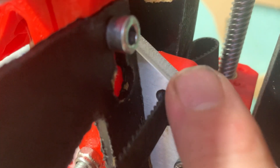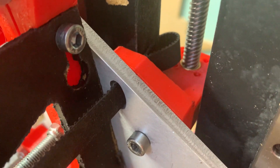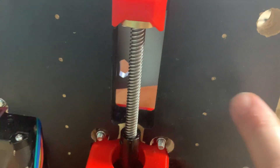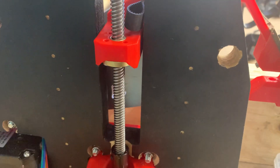Another thing to be careful about: it's a clever design, but there is an angle on the stud that must match the angle on the XZ plate. You really want that angle lined up. I'd suggest googling 'winding sticks' and watching a short video — you get right on the angle, bring it down until things just disappear, and verify the alignment. If this piece is turned wrong, the lead screw will be twisted at an angle, no longer parallel to the screw holes or the linear rods, and it throws everything off.